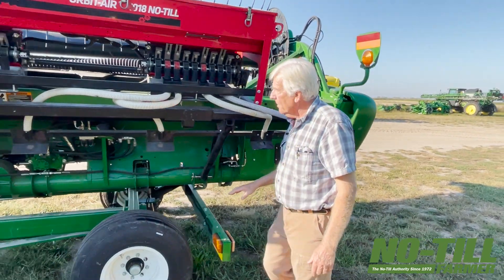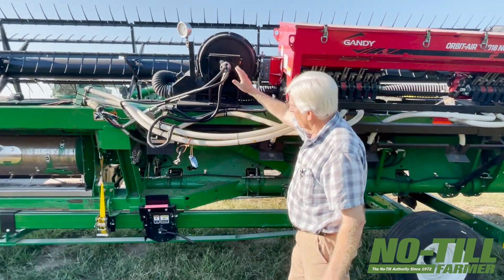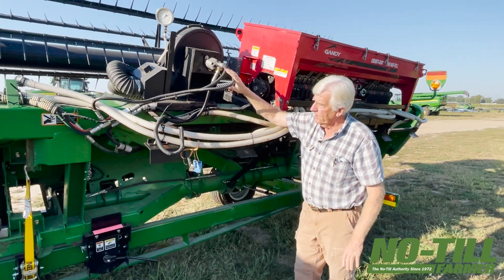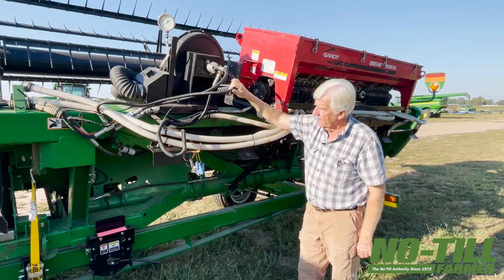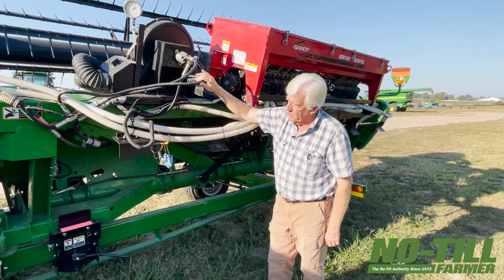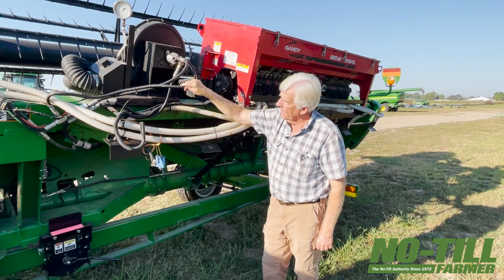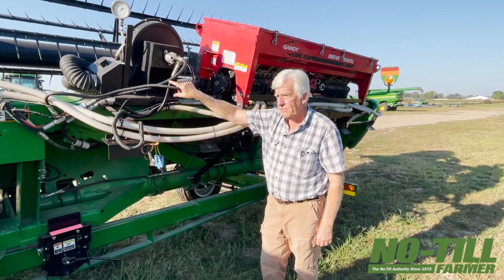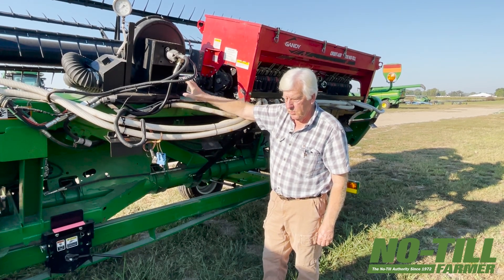It is so accurate at putting it on that it covers the ground completely. This is our new head mover. Here is the hydraulically driven blower. This is a bit of a problem because you have a blower on this one and that one down there, and you've got to keep up that hydraulic power — there's no port for that, so we're plugging into the hydraulics of the head and stealing oil away from the reel.